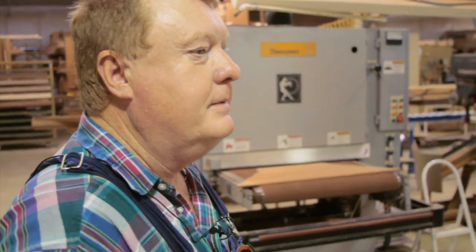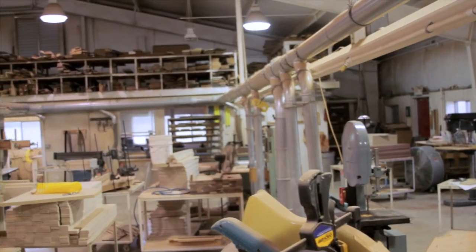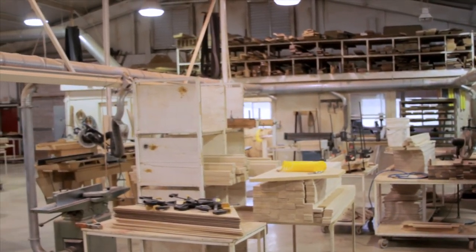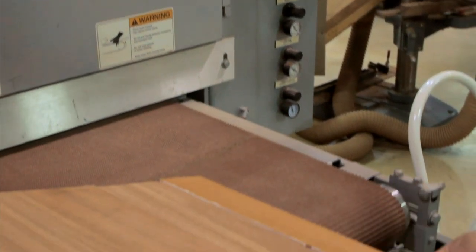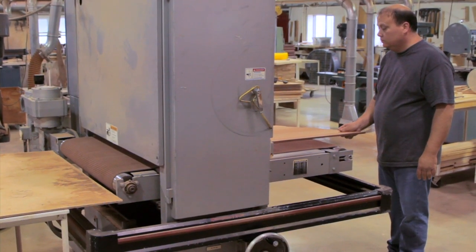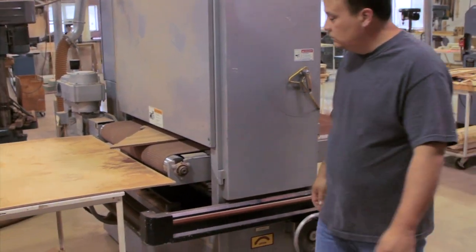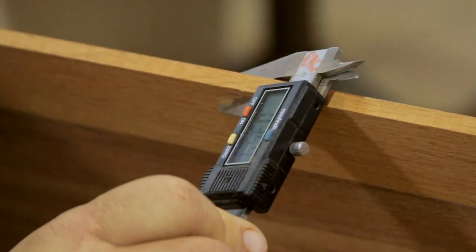We have a wonderful dust collection system — I'm really proud of it, especially after building for 10 or 12 years by myself using a box fan and a window for dust collection. We had this system designed professionally for all the different pieces of equipment we have. It's adjustable, very safe, and you can work out here without having to wear a respirator. This is the time saver — it takes a piece of wood that's multiple thicknesses or pieces that have been glued together and sands it down to where it is perfectly flat to five thousandths of an inch. You can imagine how important that is for these large flat soundboards and backs for the hammered dulcimer. The name is very accurate — very time saving.